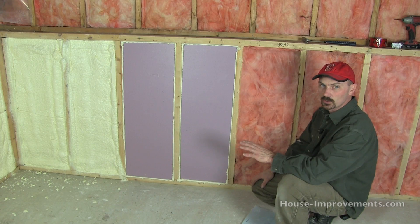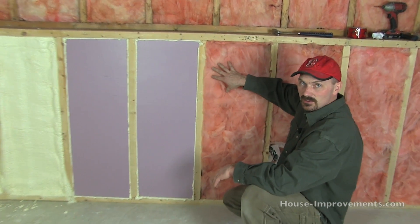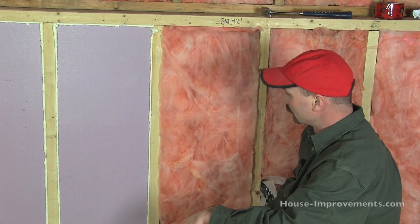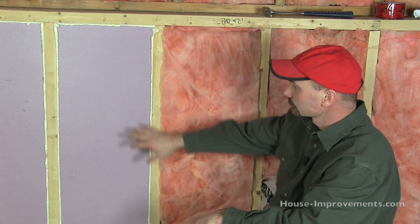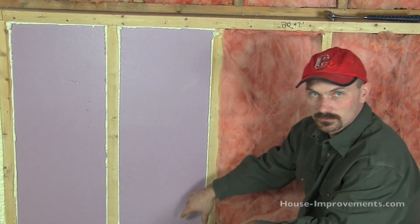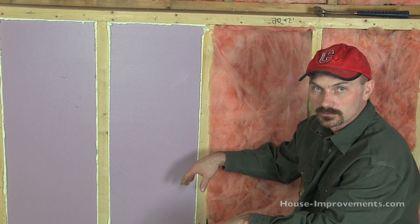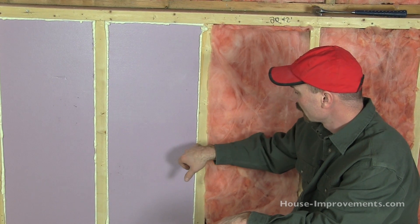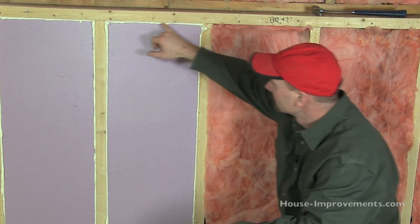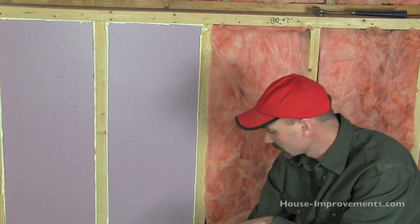Three different ways you could go about insulating this would be: what most people would normally see, which would be the batt insulation fit between the studs — so that would be this style. Right here we have a sheet of rigid styrofoam insulation, cut about a quarter inch smaller than it needs to be to fit the space, inserted and then spray foam from a can that seals the gap all the way around — so that would be the second type.